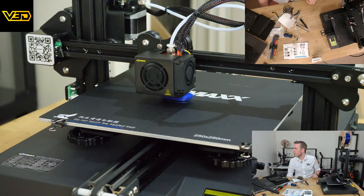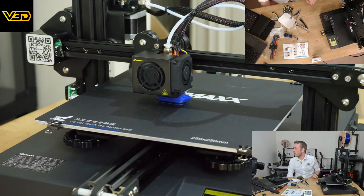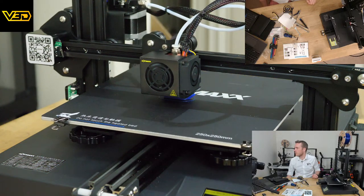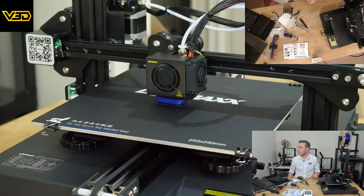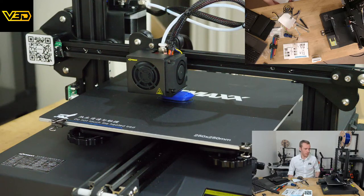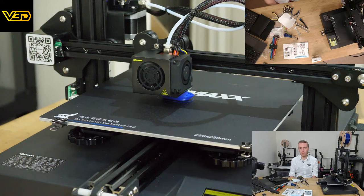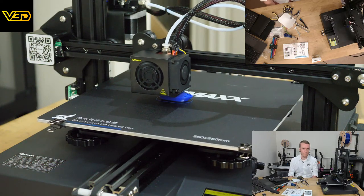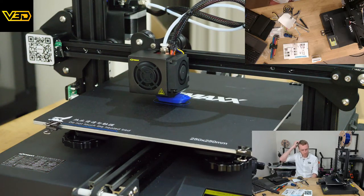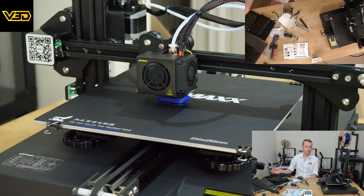I've missed a few comments. Question: many BigTreeTech boards are intended to run with the TFT. Might there be a problem when you print via the TFT, since that is sending the G-codes over? One of the problems I have encountered, you have to be careful. It's a little bit like printing over USB, like from a computer. Typically, we moved away from that because of Windows restarts and power management on computers. They're way more complex devices, so it's difficult, unless you're really into computers, to make sure that whatever they do is not going to stop that streaming of data.